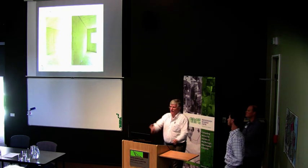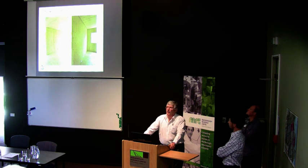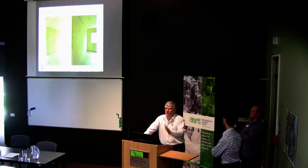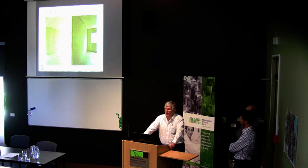What you're looking at is an example of a building where cross-laminated timber can be used without any structure to support concentrated loads. The idea is that loads are distributed down through the building through intermediate internal walls to the foundations, so you don't need a skeletal structure of beams and columns to carry those loads. This honeycomb construction is being used overseas to build buildings up to — well, one in Melbourne that's just been topped off is ten storeys high, and that's the tallest one so far.